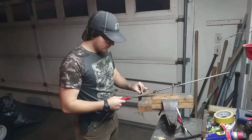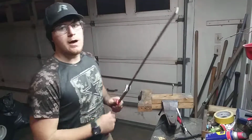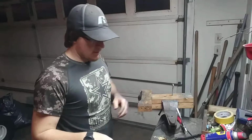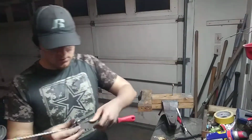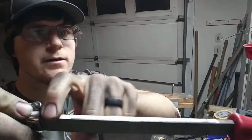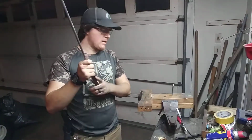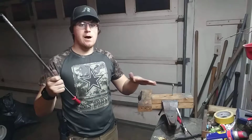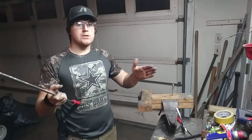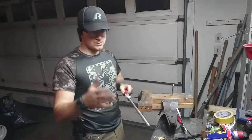Now, one thing I do is, and this I learned from Alex Steele, which he learned from ClickSpring, and those are both YouTube channels. And if you want to learn this, it's very simple. On one side of the file, I don't know if it'll show up on camera, but on one side of the file, I ground it flat to where all those teeth are gone. So when I go to start filing the plunge line and I'm hitting against the stop, it's not grinding into that stopping pin, or the stop screw, nor is it making my plunge line start going back towards the actual choil of the knife, and it stays even. It stays straight, looks good, and it doesn't start curving out.